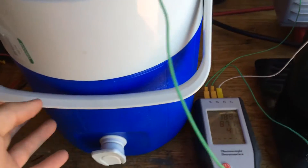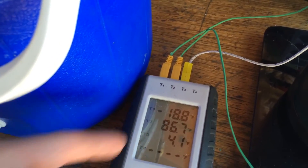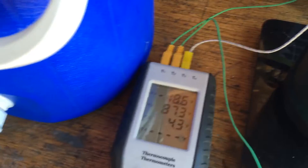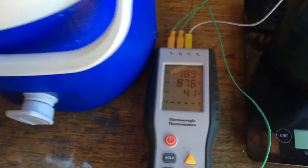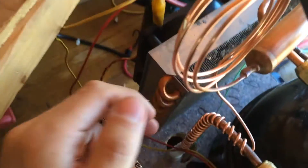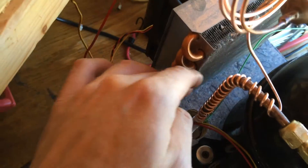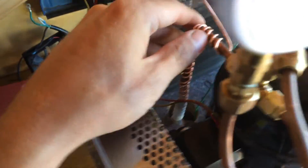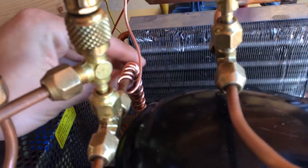Then I can chill the bucket and try to do some passive cooling. The suction temperature is about negative 19, and we have about 10 psi on the low side, which corresponds to negative 21. I'm not too worried about the small amount of superheat, because that temperature is taken down below where it's frosting, and the heat exchanger is taking care of any slugging that might occur. That works pretty effectively — supposedly it adds some capacity to the refrigeration system. It's not going to do anything for efficiency, but it's effective.